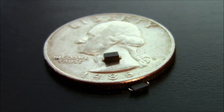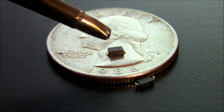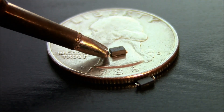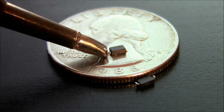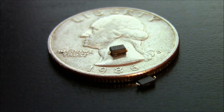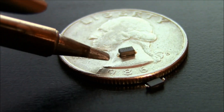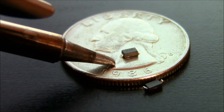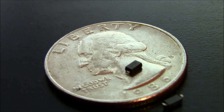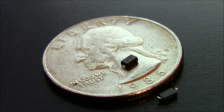If you're going to try to solder this with stock iron tips, that's probably not going to work. The iron tip is even thicker than the whole diode. You're going to have to get a much finer tip. This one from my other soldering iron is about 1.4 millimeters, and that's barely small enough to solder these diodes. I also have a hot air station, but for today I'm just going to use the smaller iron tips.